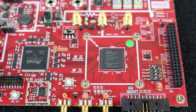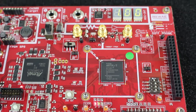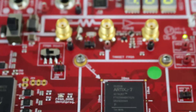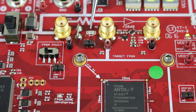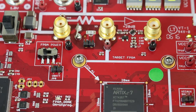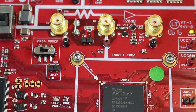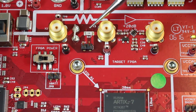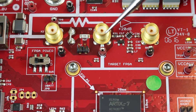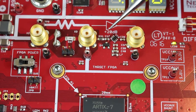Some of the other stuff that makes this board very different from a regular FPGA target is up at the top — there's a shunt resistor, a little surface mount shunt resistor right here. This lets you do power measurement, so you can see what kind of power leakage something like an encryption algorithm has. It lets you make really easy measurements using either an SMA connector directly connected to it, or with a 20 dB low noise amplifier.